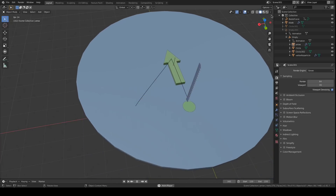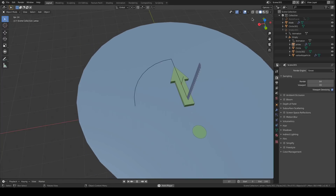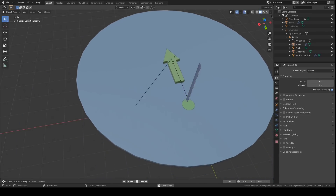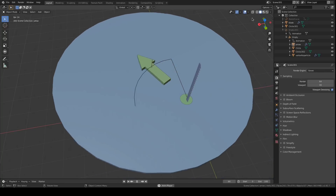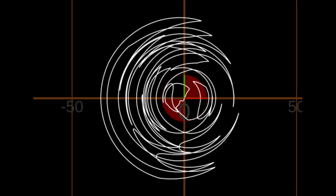Generating the gcode for the control board, which has a Cartesian kinematic model, means we have to generate many waypoints to avoid the machine incorrectly interpolating. I spent a lot of time getting this right, and while it works okay now, if I did this again I think I would look into implementing the kinematic model in the control board and keep the gcode generation simpler. This is a gcode preview of the first shape drawn in this video and shows the many arc moves needed.